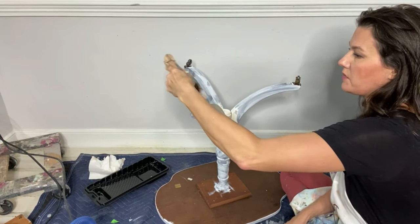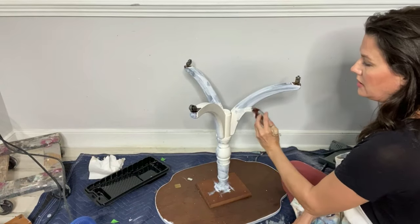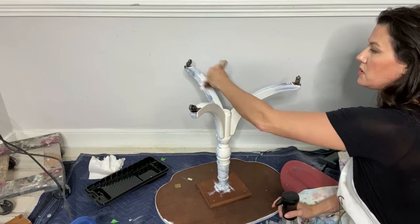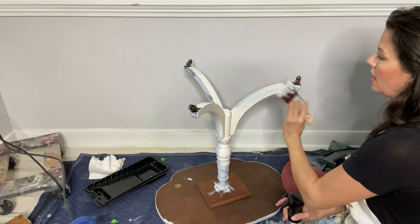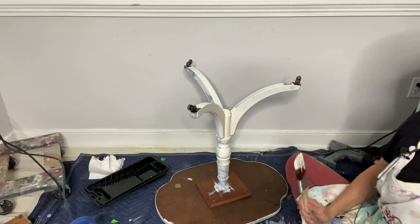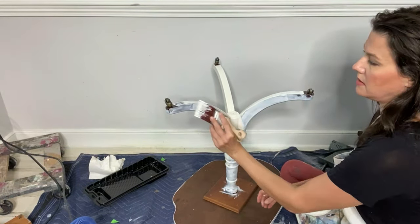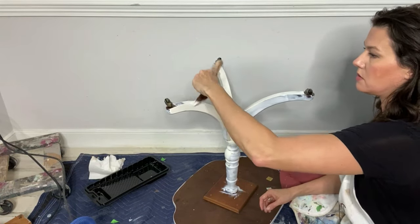She's wonderful. So when you paint with chalk mineral paint, you can spray it to dilute it a little bit. Like when I say your spray misting bottle, you can spray your brush or you can spray the piece just to get that paint going on a little bit smoother. It's up to you. But I usually use my spray misting bottle on the second coat. The first coat is not usually where I'm using my spray misting bottle, because I want my paint to be kind of thinned out on the second coat, not the first. The first coat is just get on there, get dry, get that base, and get going. So you'll see me use my spray misting bottle more so on the second coat.